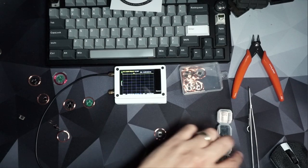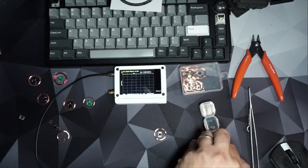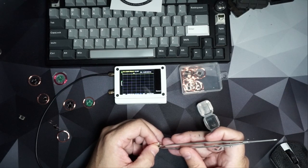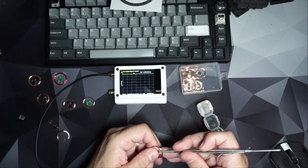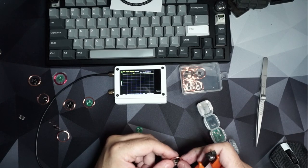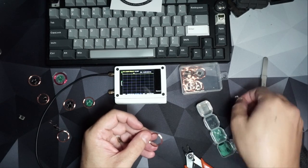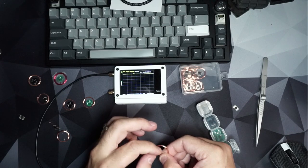The idea is you would take one of these adapter PCBs. I'm going to rip the coil off of this chip — it's just going to be a donor so I can steal the coil. The chip's off. I have the coil here. I'm going to take the two leads of this coil and run them through antenna one and antenna two on the board.